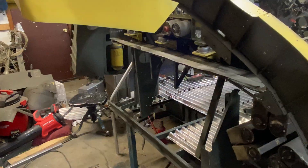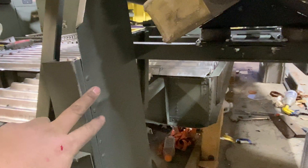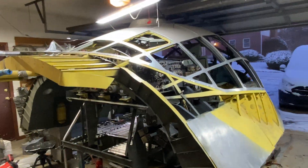Hopefully I don't redo things I've already discussed, but I just watched my last video. Last week I cut off — I had the initial beams here. The first thing I had to do was realize those beams weren't long enough because this surface right here was convex. I quickly realized they weren't long enough, and since this surface was actually bowed out a little bit from years ago when I built it, I had to go in from the other side by de-riveting the skin and install these horizontal beams.